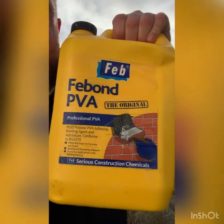The finish on this one is a little bird beak joint — a little pointed joint between all the slabs. The gauge we're doing for this is three building sand to one cement. You can use a trowel or a shovel — just make sure you keep the falls the same size every time, because you don't want to be altering the colour. This particular one I've used my normal brick trowel: six trowels of sand, two trowels of cement, adding water, and then plenty of Febond PVA.